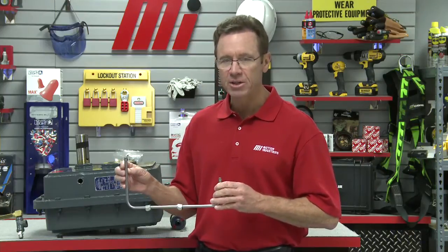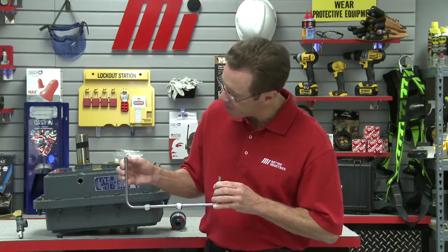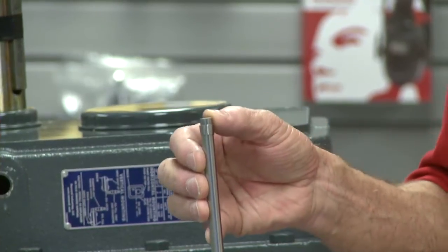Do not further disassemble the sight glass sub-assembly as it's been sealed and pressure tested to be leak free — we don't want to touch that at all. Slide the tapered split ring onto the tubing with the narrower diameter first, making sure the large end of the tapered ring is facing the mating fitting. You can see the larger end is up there towards the top.